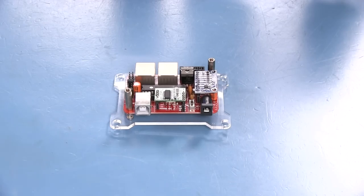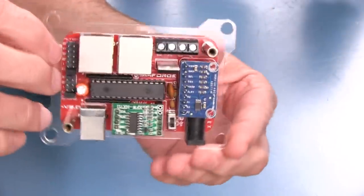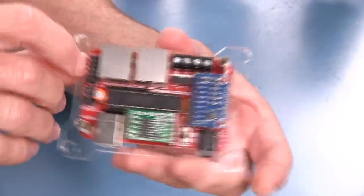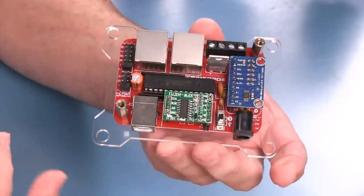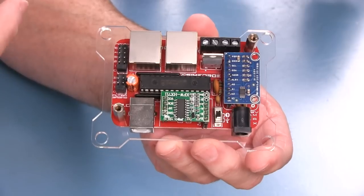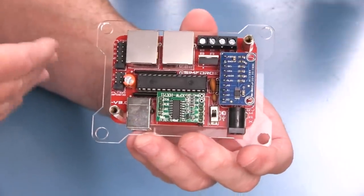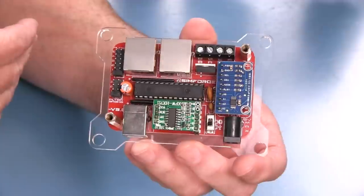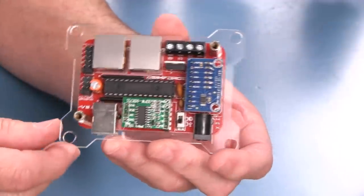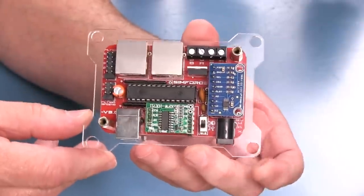And we're going to go over in detail how they decided to approach that. So let's take a look at the new, improved circuit board. First off, this board's main purpose is to help mitigate the EMI interference that we get from electric motors. That can be anything from a motion system to a direct drive force feedback wheel. It can be a fan system, if you're running fans on your rig. As an extreme example, I have a 6DOF system. And with that, my direct drive wheel, and the fans I'm running, I have no less than 10 separate electric motors running at different RPMs when I'm actually racing.